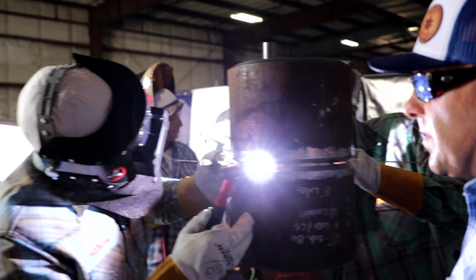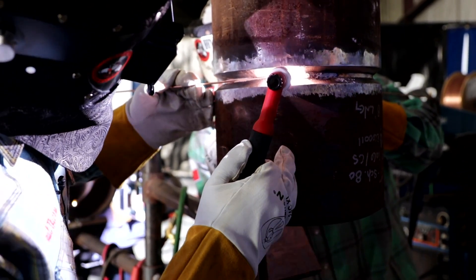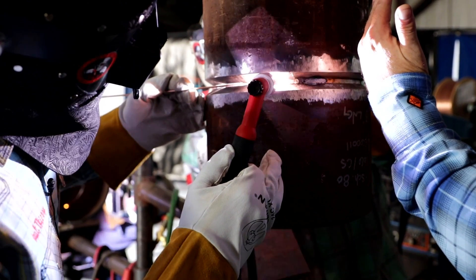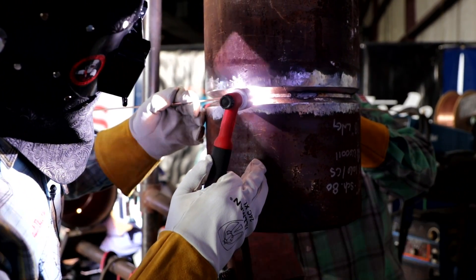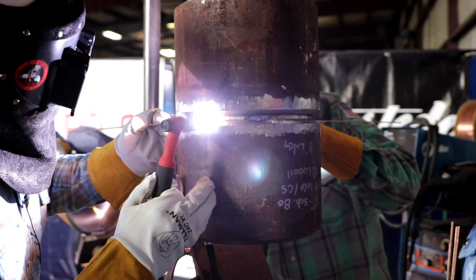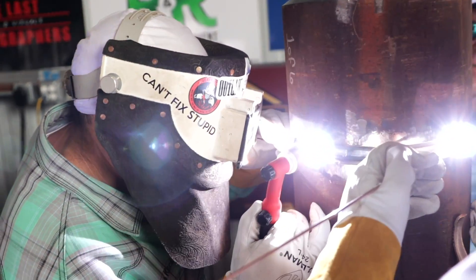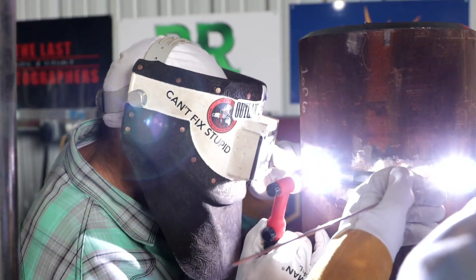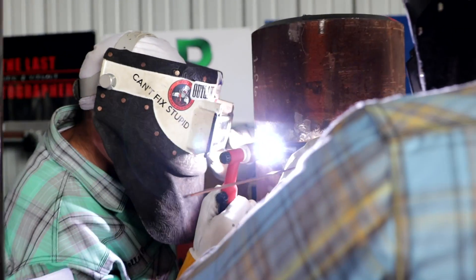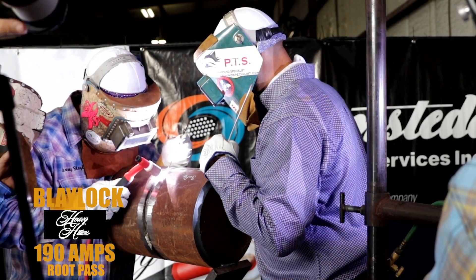Over here, Mr. Paul Theria — what are you running on, Paul? Like 185. He's rooting on 185 amps. He's got about a sixteenth of an inch gap right here — a real tight eighth inch. He's just breaking the walls down, key-holing it all the way across. Mr. Dallas DeCase back here on the other side — what are you rooting on, Dallas? About 180. So Dallas is running on about 180 amps, running about the same gap — tight eighth inch, loose sixteenth. How hot you running, Blaylock? He's beating on 190 right here, coming over the top.